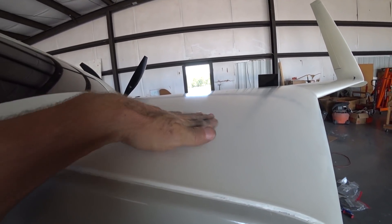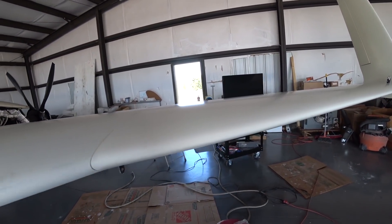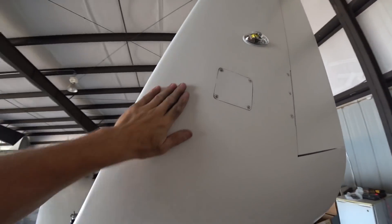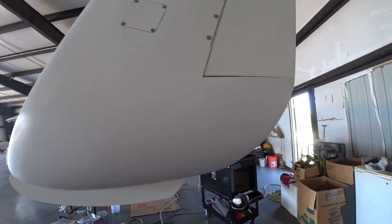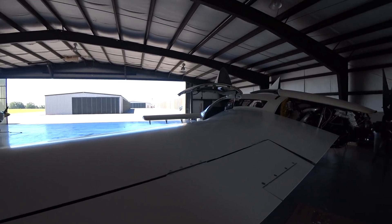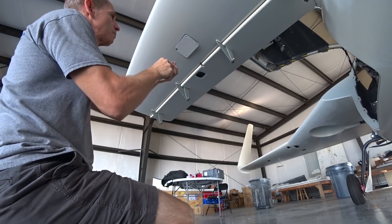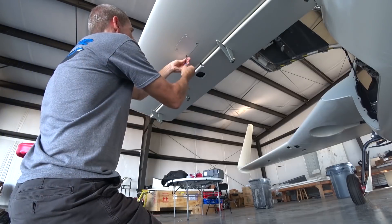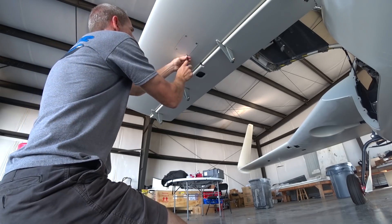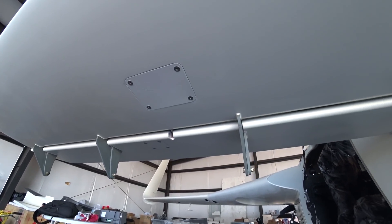In the afternoon I worked on the roughness of the surfaces on the wing. It was basically overspray - sprayed one side, then the other, and the overspray landed on the first side. I wet-sanded it with 400 grit, then got the buffing wheel out and used a little correcting compound. I got one wing done so far - the top and the winglet - and I just have to do the bottom of that one and then the other wing the same way. The fuselage really doesn't need much, maybe just a buff, and then the nose as well.